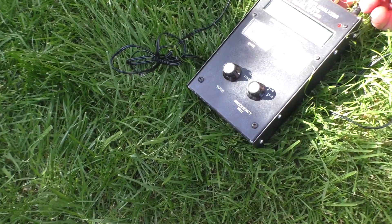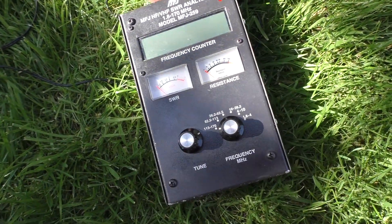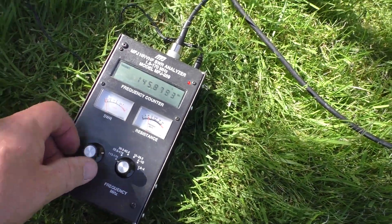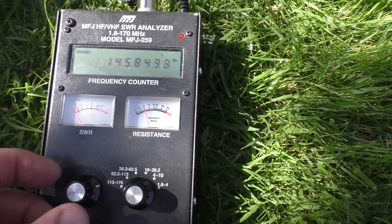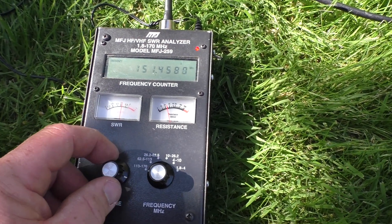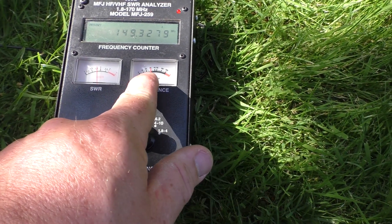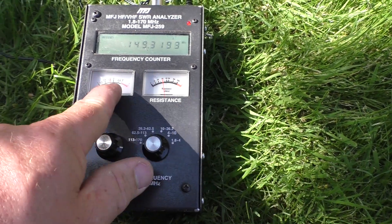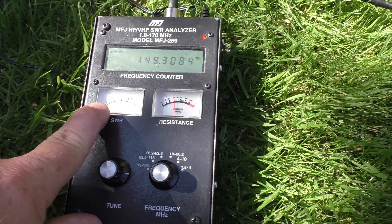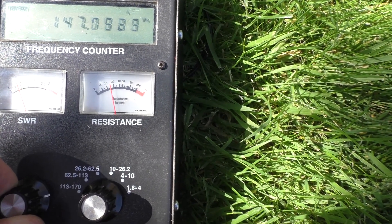Let's plug in the antenna analyzer. Since this is a 2-meter FM antenna, 145.400 MHz is where we want to focus. I've shown how the antenna analyzer works before so I won't go into detail. Starting at 153 MHz — which is well out of band — and turning the knob to bring the frequency down. You can see the resistance rising toward 50 ohms, but most importantly the SWR: we want it below 2, and as close to 1 as possible. Coming down toward 145.400 MHz.